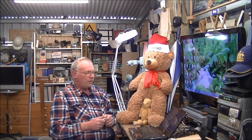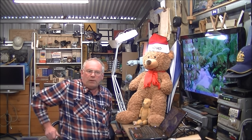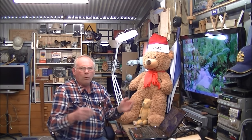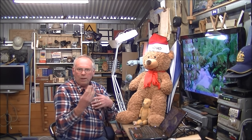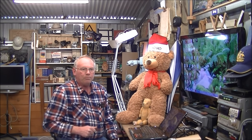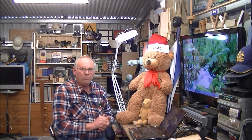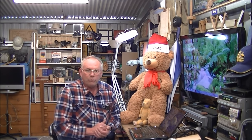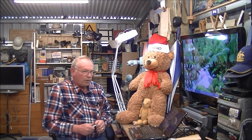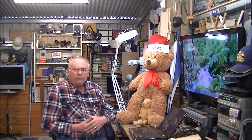So we select cut one, make sure we've got G-code millimeters, save — it's picked up my storage device on my E drive — I'll call it cut one, 6mm ball mill, and save. Done. So I hope you've enjoyed this and understand a little better how a grayscale image straight off the internet can be put into a CAD/CAM program, made into a relief, with the toolpaths drawn up and saved to a storage device. We'll put it in the machine and cut it — but that'll be for the next video.